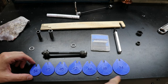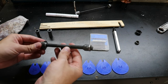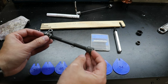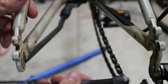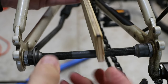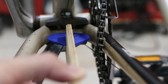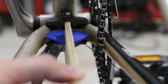Last night I went ahead and printed pretty much all the sizes, at least from 34 to 54mm. I also came up with a different approach for the whole axle setup. What I decided to do is lock two nuts together at 135 millimeters apart. That way I can simply put the axle in just like that and it holds itself, or I can put the skewer through it too. The 54 millimeter tire will clear according to this, but it's pretty close — that's probably the max on a 27.5 wheel.